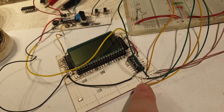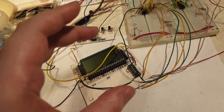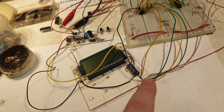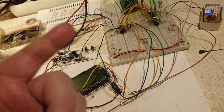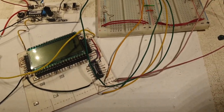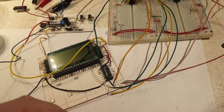All the inputs I have here are parallel inputs — I'm driving one by one, not serially. That's the whole reason I'm building this complicated driver. I have parallel inputs for each digit and can command each segment for each digit independently from whatever logic chip or microcontroller I choose. It's very hard to build but very easy and intuitive to drive in parallel compared to serial.